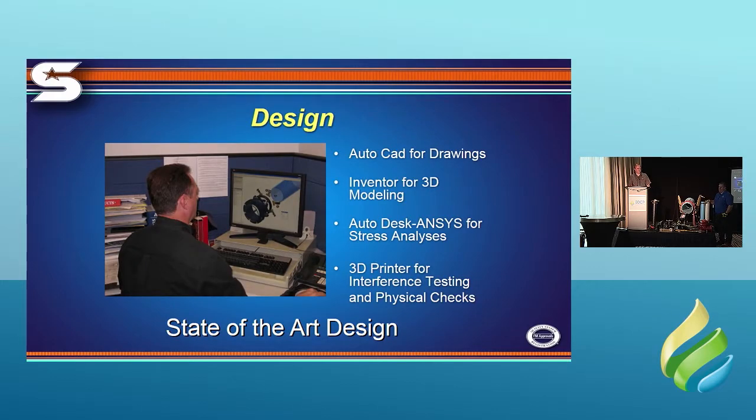Design, manufacturing, and how the product gets to you. When fittings or restraints are designed, we use up-to-date software. We're using the most advanced software that's out there to make sure that we meet pressure ratings, it'll work, it won't twist, we check bolts. So we'll use AutoCAD and whatnot. We'll also use finite element analysis to make sure that stresses are what they're supposed to be. We'll beef up areas that need beefing up. We'll let a little less material go in other areas if it's allowable.